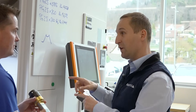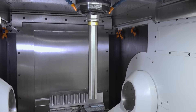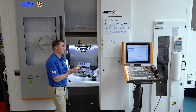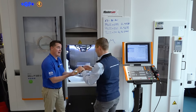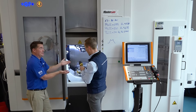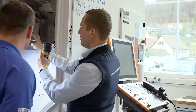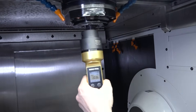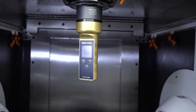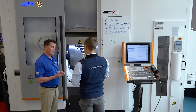We can directly try it if you want. I'll take out the master bar — I'll be your Vanna White today. Thank you very much. Instead of giving you a letter as Vanna White would, I give you a tool. To test the retention force: press the button, open the retention mechanism, put it in, and now you can directly read your retention force on the machine. I see 21.6 — and what are the units? Kilonewtons.